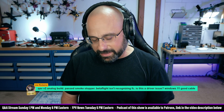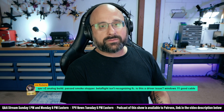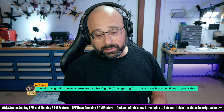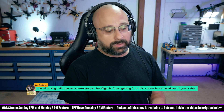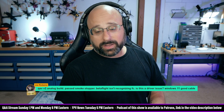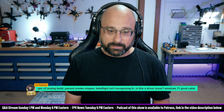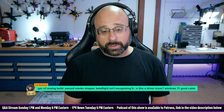Here's the thing about that — I know people run the ImpulseRC driver fixer reflexively, but it fixes DFU mode, so it shouldn't affect your ability to connect. Although I've seen at least one case where it did. It's not a bad idea though — download and run the ImpulseRC driver fixer and see if it fixes it. I think it's more likely to be an issue if you're trying to flash than if you're trying to connect, but it's not out of the question.